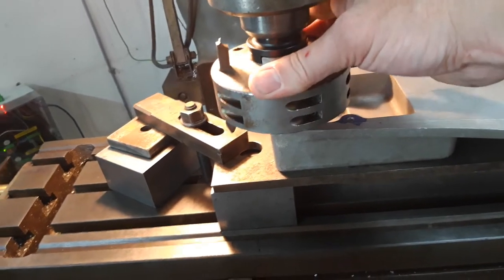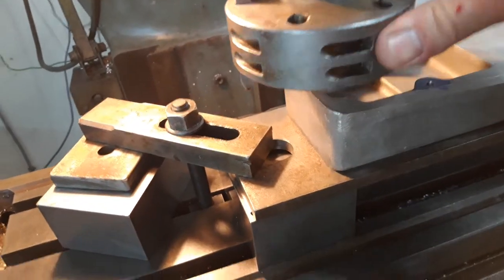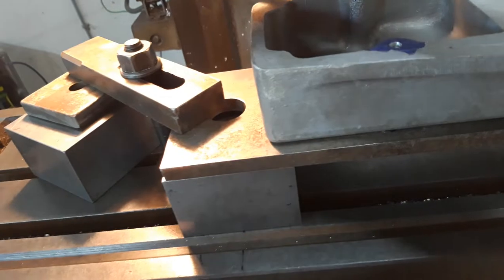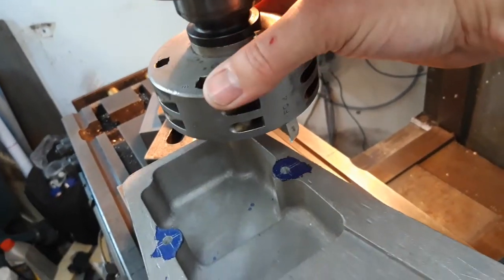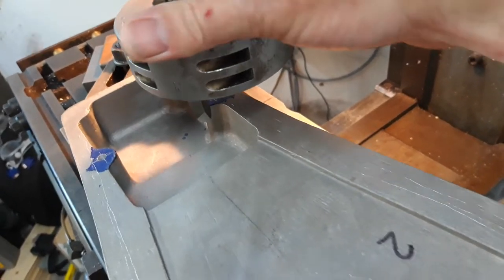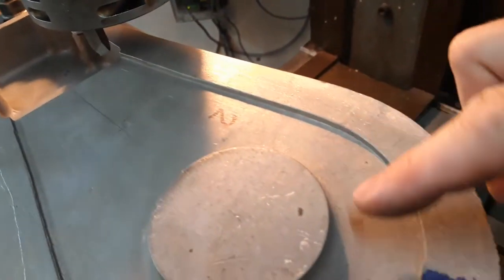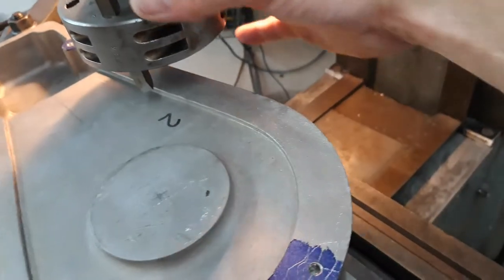So I'm going to cover everything. I'm not going to clout these clamps as I come past, which is important. I'm going to make sure I get right over to the other side there — absolutely no problem. And then on the return path I just want to make sure that again the tool isn't going to take anything off this centre boss, because this does need to be proud of the mating surface.